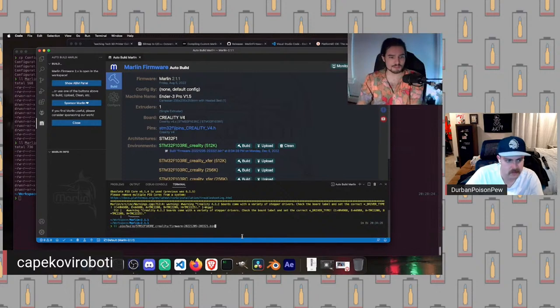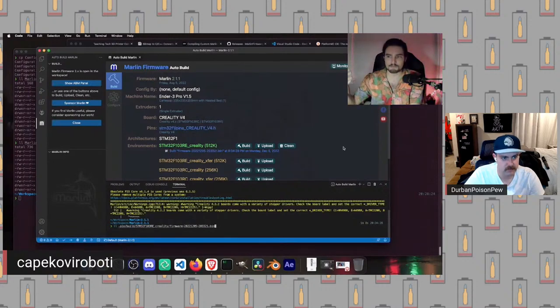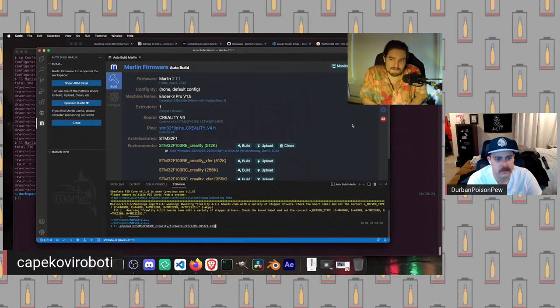So the good news is, because of that, they will always be unique. And so we can keep a bunch of old firmware binaries in a location somewhere, totally unlabeled, and they won't bump into each other. Some boards will only take a file named, e.g. firmware.bin, in which case we will need to have a more clever naming scheme in order to keep multiple copies of the firmware binary, because otherwise their names will collide.